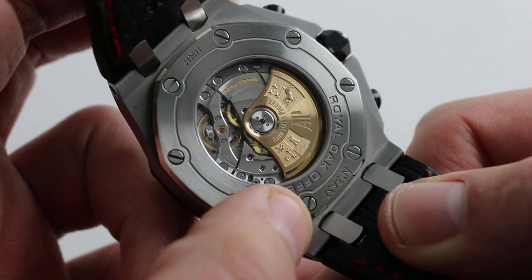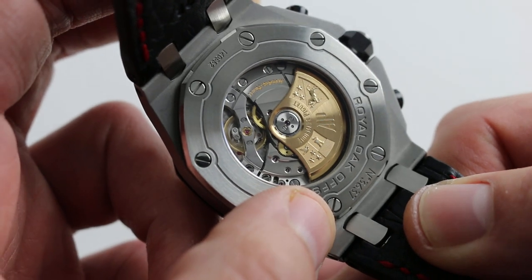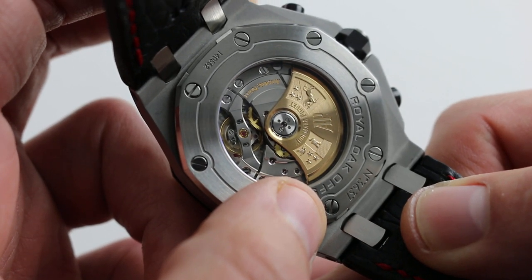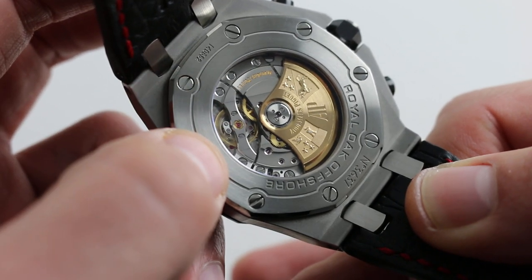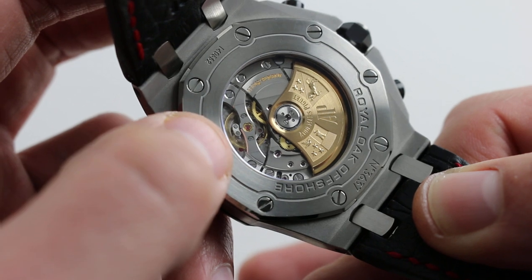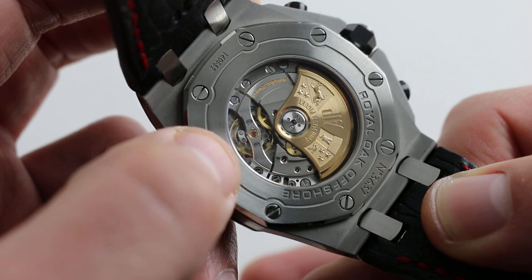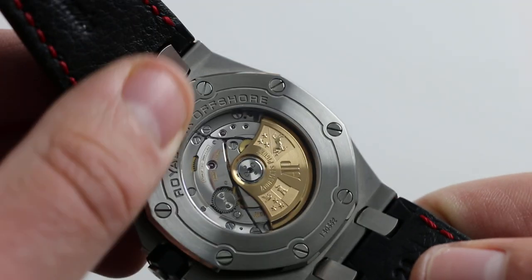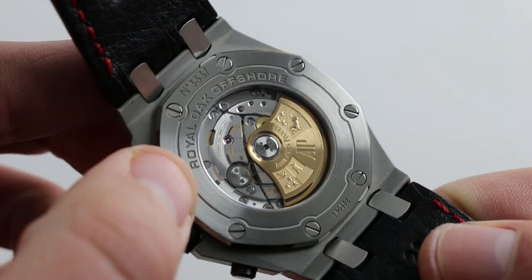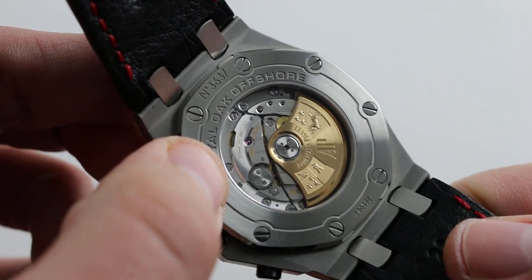While the bi-directional system gives up a few percentages in winding efficiency, Audemars Piguet wanted a bi-directional winding system — Rolex style — because it sounds and feels more refined on the wrist and doesn't have the unidirectional rotor wobble. This is a true sports watch movement with a dual-anchored balance bridge and a free-sprung balance beating at 21,600 vibrations per hour. The free-sprung architecture makes it more shock resistant. It features a superb power reserve of approximately 55 to 60 hours, considerably more than the industry standard of 42. The level of finish entirely warrants the display caseback.